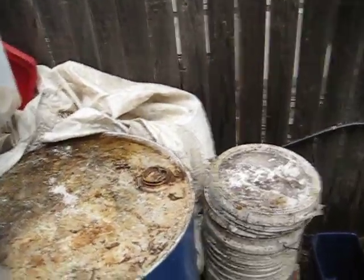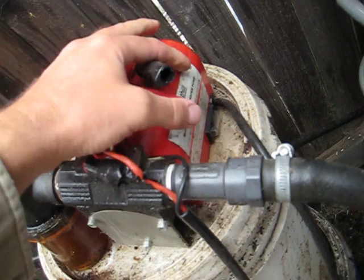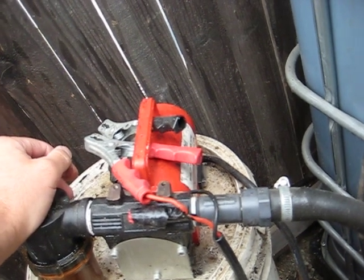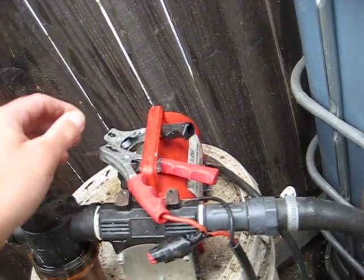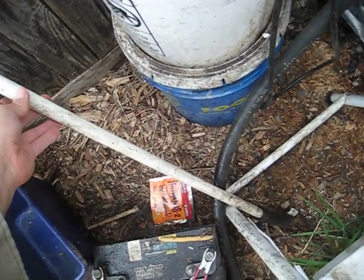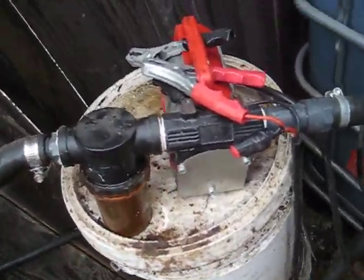From this I'll pull off the top two-thirds using a pump — it's a 12-volt pump, a Tuthill, model FR1612. The problem with this is the fuse kept blowing when I was using it. I found that on my other pump as well — the wires weren't crimped properly. So I just took the fuse out and it's been working fine. I have a pre-filter on this so I don't want anything to clog up the pump. This pump doesn't have a filter on it, so I just plumbed in a filter right here before the oil goes through the pump.